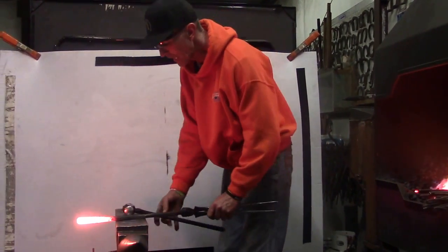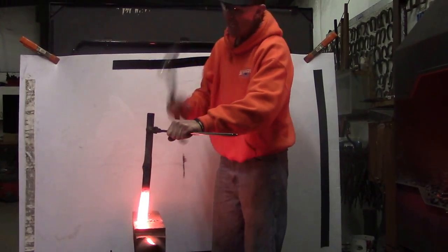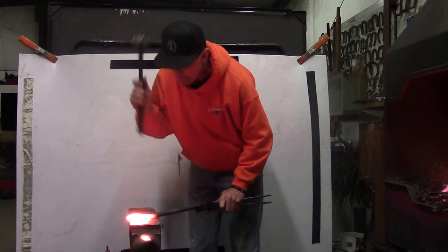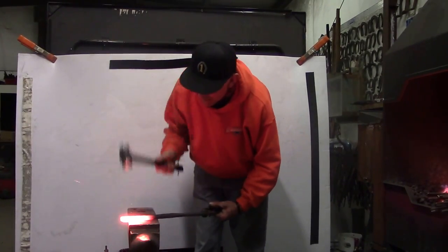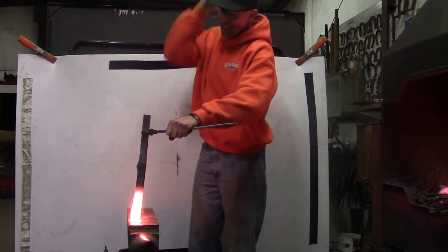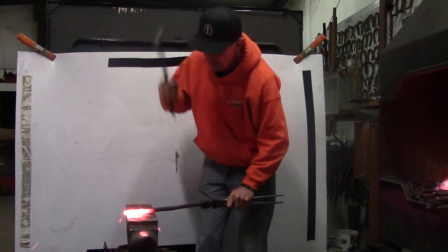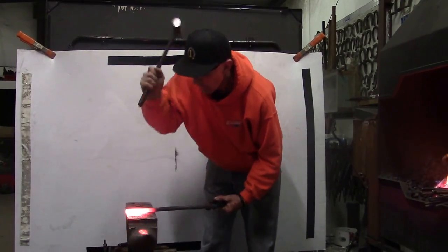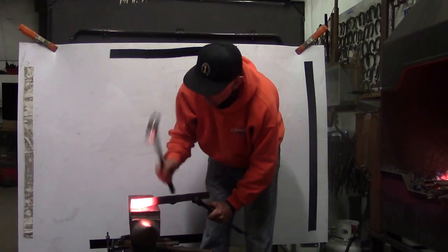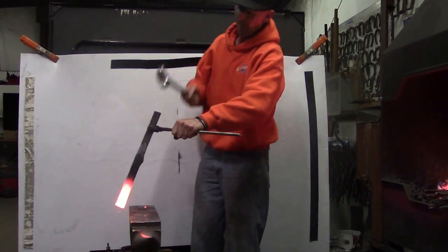All right, I'm going to upset the outside heel, and the reason I'm upsetting the outside heel first is because I don't know exactly where that Masselot is going to be. Like I said, I didn't pull it exactly in the center, but I'll have a better idea of where it exactly needs to be after I bump some material into the lateral heel. Just put a little bit of bump in there so I've got some fudge room to build that nice, pretty outside heel.